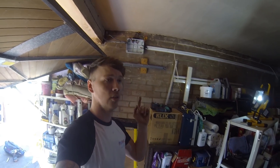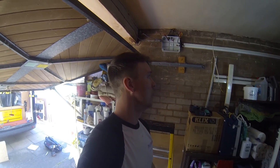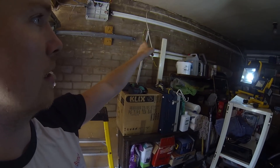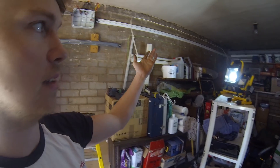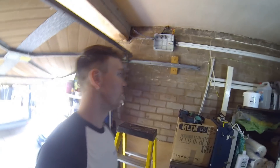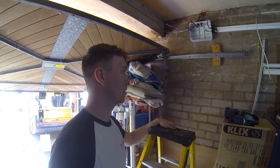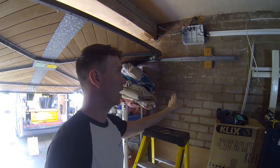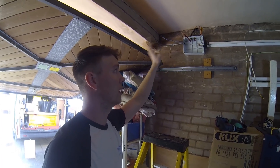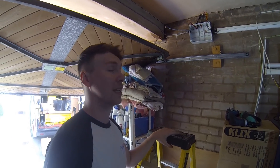The adaptable box is up and on, and the cables are through it. It's a bit messy at the moment - I'm going to rejig some of this old trunking. Someone's done a nice thing and upgraded the bonding to 10 mil. I'll go around with a few metal clips afterwards. I've got a Hager split-load board, 10-way, so I'm going to get that out, mount it, measure out the trunking run, feed the new cables up and label them through to make it nice and neat.